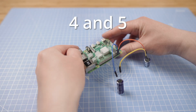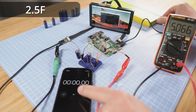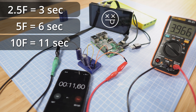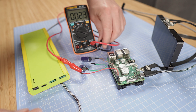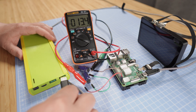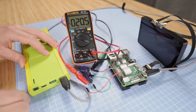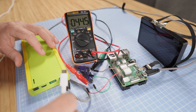On Raspberry Pi, supercapacitors can be connected to these pins. Let's test how long these supercapacitors can hold the Raspberry Pi running with the stress-ng application to make maximum load. It does not work as expected at first — I connect the multimeter here to monitor voltage. I'm connecting power and can slowly charge these capacitors by pressing the button on the powerbank, but I can make it faster with external power.